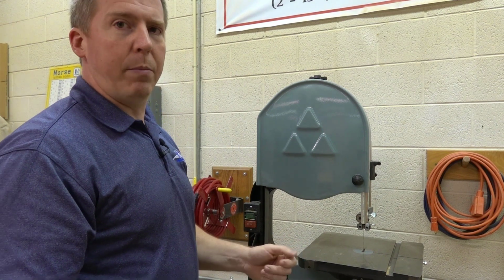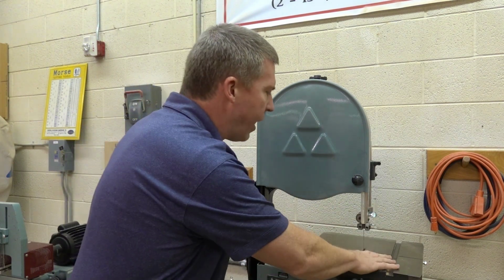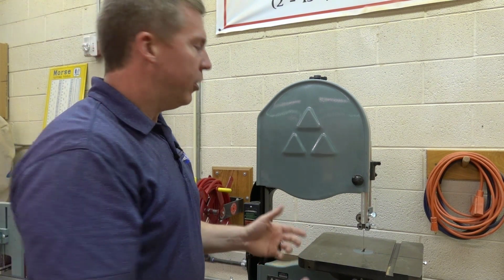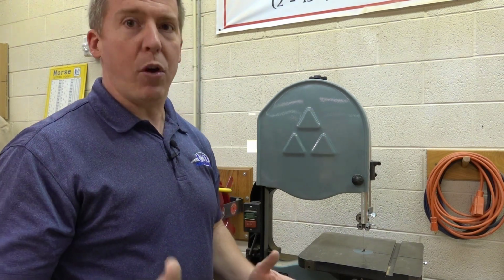So, should a blade break, should anything happen or go wrong, or a sound you're not accustomed to, you don't want to hear, get your hands out of the way, away from the blade, and then turn off the machine. So step away. Don't try to catch anything. Don't try to save your board. You can always make another one. Turn off the machine and keep your hands safe.